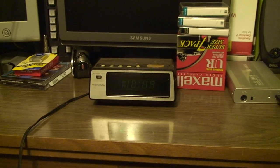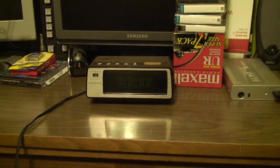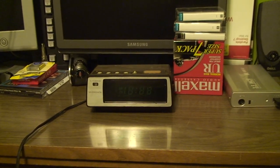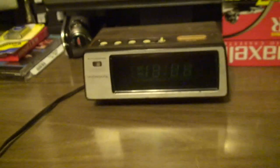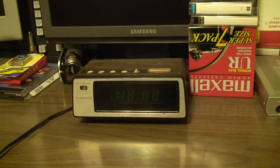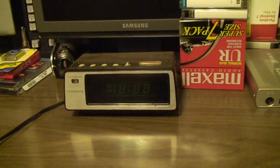Secondly, because it's something that Radio Shack released to market in their 1980 catalog, it is a good example of an early electronic digital clock with microcontroller or microprocessor control — if you could call a dedicated-purpose clock controller a microprocessor, because in a way it is. This unit has an automatic dimming function that allows it to vary the intensity of the display based on how bright the conditions in the room are, so when it's dark in your room it will darken the display considerably, and when the sun is shining in through your window it will brighten the display so that you can see it reliably.